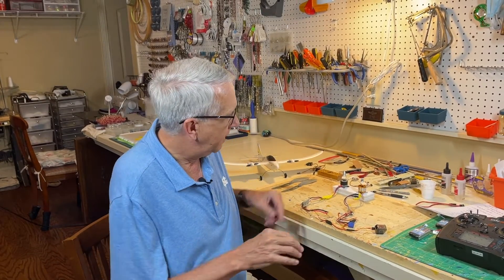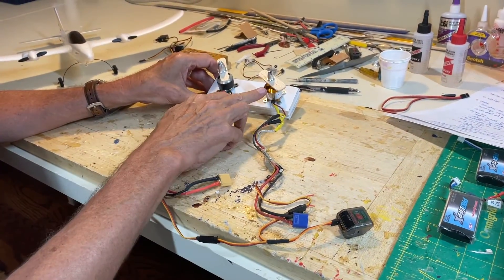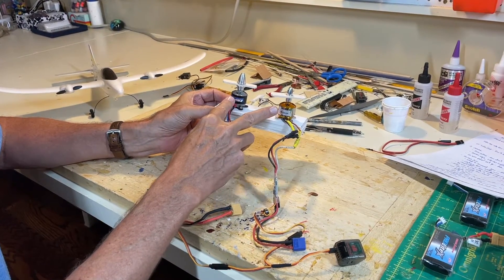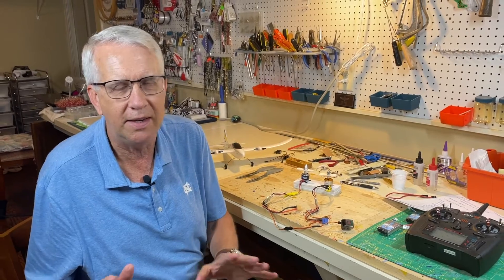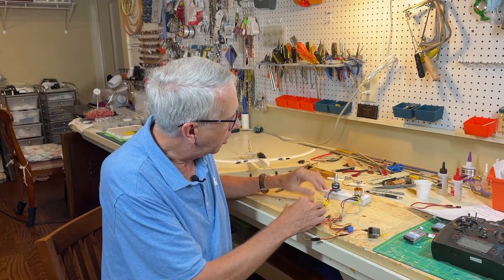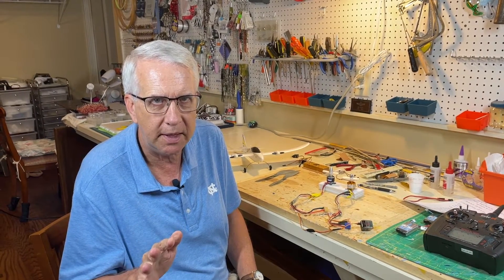Now, the important thing about the BEC in this twin setup is as follows. I am not using the same motor for both just to save a little money — I just took two motors out of my parts bin. For a sport model that should be okay, but for an important project you'd want identical motors. The key point: this setup will have two electronic speed controls and two batteries, which is the easiest way to set it up. If you look at the ESC, the middle wire here is the BEC wire — I've cut it. When you have two BECs both trying to talk to the receiver and control the voltage, they'll fight each other and get confused. So I keep one BEC wire intact for one motor, and cut the other. Then I connect them with a Y connector to go into the receiver, so the receiver sees only one BEC connection.